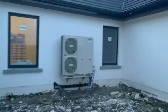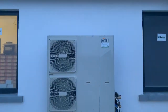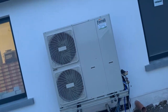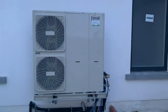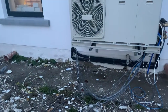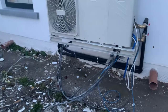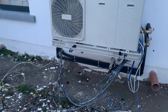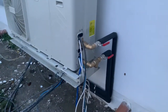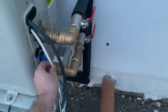As far as the heat pump install goes, there were a few hiccups. When I arrived in, it was leaning at an angle — I was told by the plumber it was level but it wasn't, so we got that sorted. The other issue was the plumber left his cables too short. When the electrician was here doing first fix, all the cables were left too short. We had some SWA — steel wire armour cable — left over, so we were able to make a temporary connection underneath and get everything powered in.